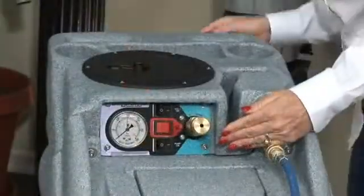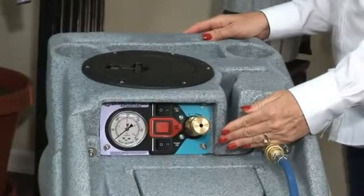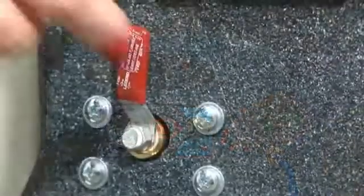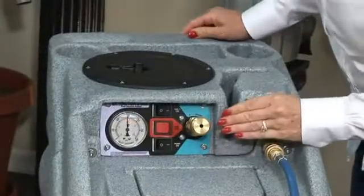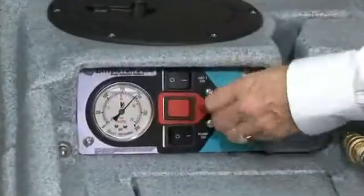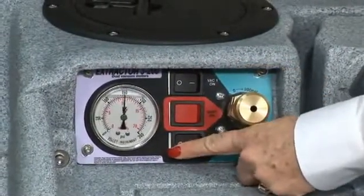This process is now pulling the liquids from your solution tank into the pump and into the recovery tank, thus priming the pump and removing any air bubbles. After 10 seconds, rotate the primer valve back to the 3 o'clock position. Remove your hand from the vacuum barb, turn off the vacuum motors, and set your pressure gauge to the desired cleaning pressure. Turn the pump off.